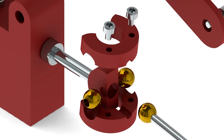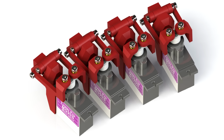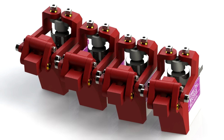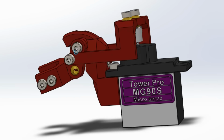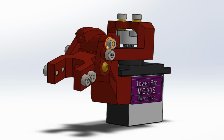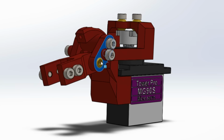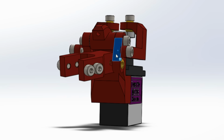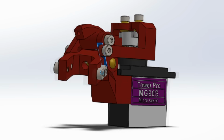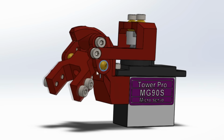But that's actually where I started designing the assembly, because I was really keen on having that little twist inwards, and that's the point that I started building the hand from, just because I was so insistent on getting that range of motion, but I couldn't figure it out. I made some assemblies and had some ideas, and I got something that sort of worked okay when I simulated in SolidWorks, but it wouldn't really have been strong enough to have any real force going through it, so I ended up just simplifying it to this double hinge joint.